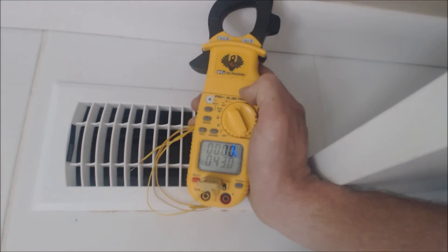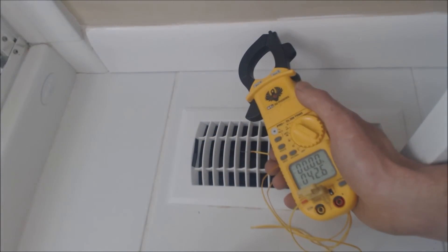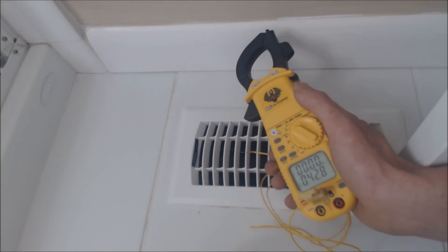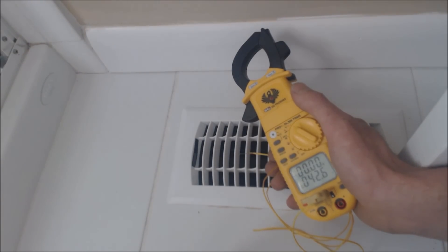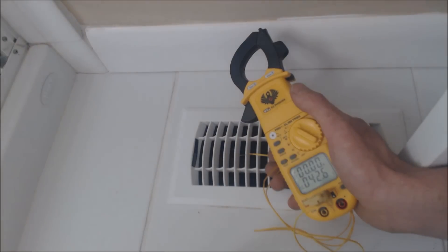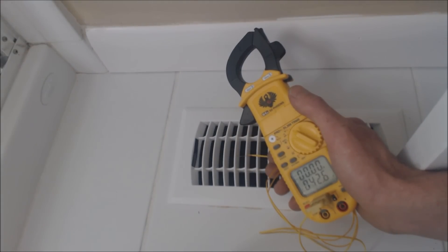At the supply register we have about 43 degrees, so we do have about an 18-degree temperature difference. Our charge is correct — we have over 18 degrees of temperature difference and we have superheat to keep the compressor safe. This is how you confirm an accurate charge, especially once the house gets down to 62 or 61.5 degrees. The only time you shouldn't get an 18 to 21 degree temperature difference is when it's really humid and the evaporator is battling that humidity. But we've confirmed that our charge is correct. Hope you enjoyed it — see you next time on the AC Service Tech channel.